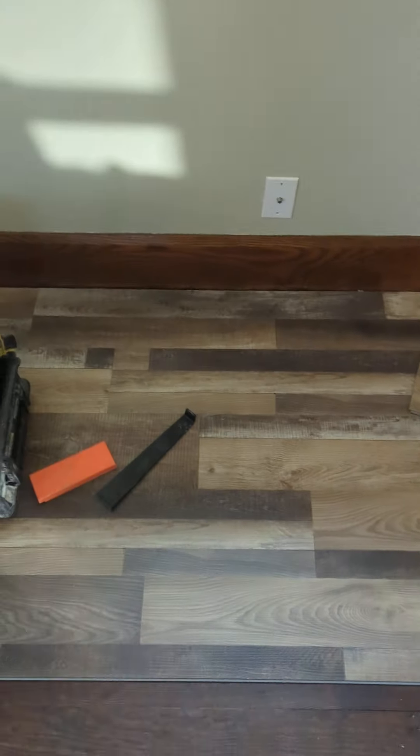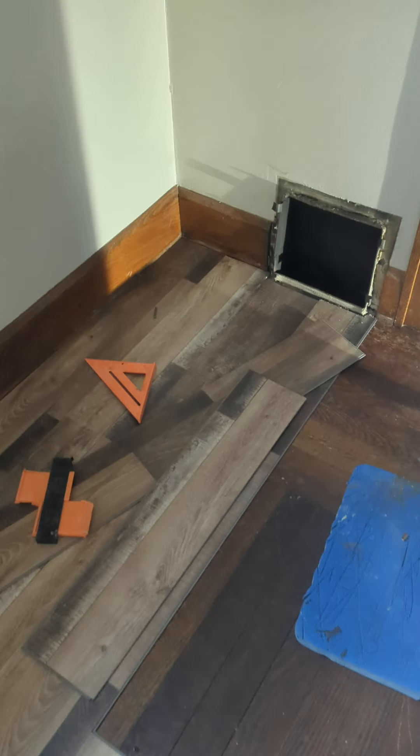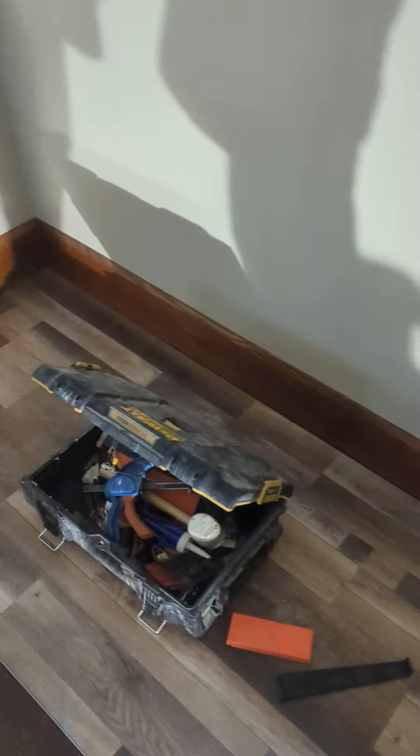The last thing I want to say about doing floors is the direction. You don't want it perpendicular to when you walk in — you don't want the floor going like this for the main traffic. You want it parallel with the direction you're always going to be walking in. Now, if you're doing LVT — which is the tile — or any tile for that matter, you want to do that perpendicular so you can see the stagger or the third-step pattern as you're walking in. Usually with 12 by 24 tiles I do a 50-50 stagger. There are too many places where you walk into a house and you can see LVP planks specifically on a 50-50 stagger and it just looks terrible, and usually it's not undercut either. A lot of times warranties won't honor it. Let me know if you have any questions.